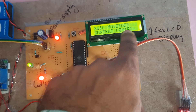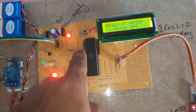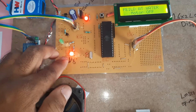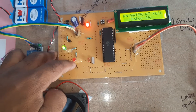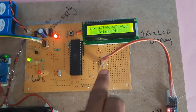Port 0 pins are connected to the 16x2 LCD character display to show the processor status. Port P1.4 is connected to the relay coil, which controls the DC pump. Ports P3.4 and P3.6 are connected to two LEDs — one red LED and one green LED — and the soil moisture sensor op-amp output.